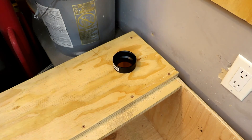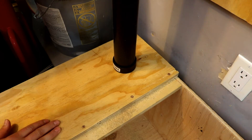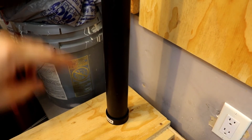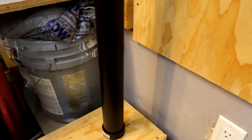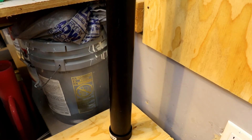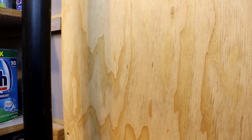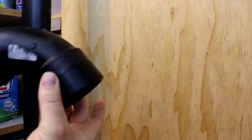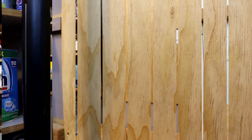The actual sections of pipe are uncut. Once that's set, the pipe will stick in part way, and up here is where we will cut the pipe off — probably about a foot high or so — so we can install the Zephyr vent. Then we'll have to pipe it the rest of the way up, drill another hole to the outside of the house, and port it off. We do have some angled pieces for angling it out, and once it gets just outside we're gonna make a little vent cover on the end to keep bugs and other critters out — especially the eight-legged variety.